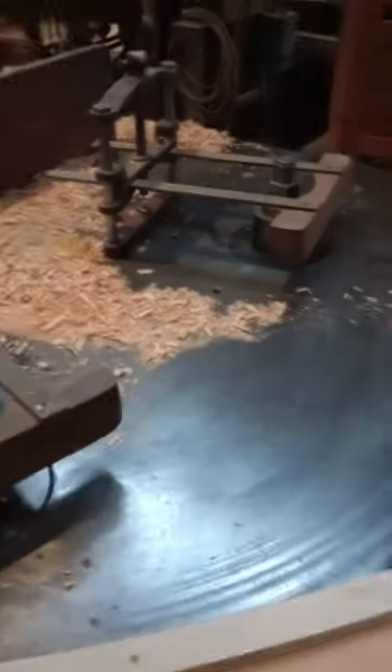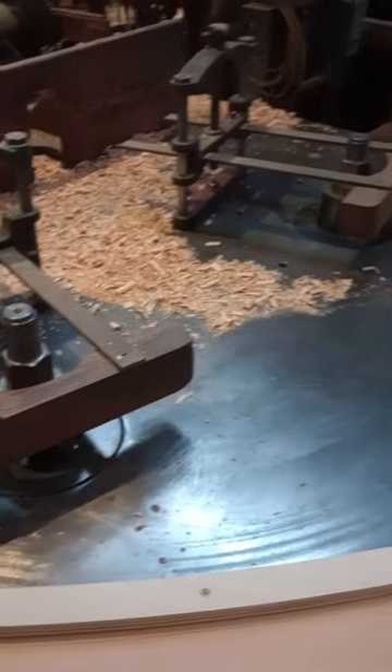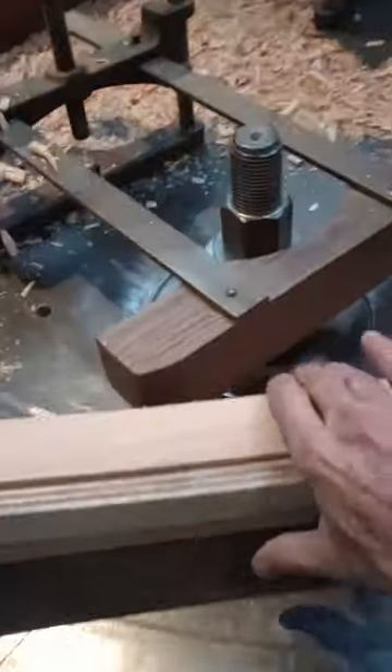The spindles are tooled the same, but they turn in opposite directions. So what that means — I have my template screwed to my part — is that I can enter this cutter and cut with the grain from this end and get to the middle of the arc.